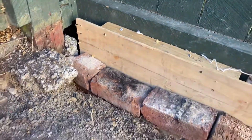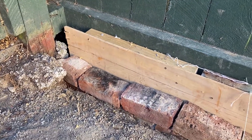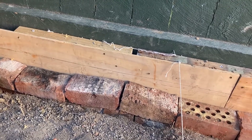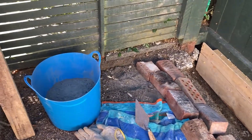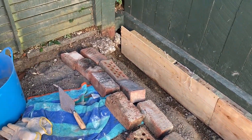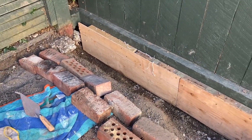What I'm going to do now is start to pull out these bricks, mix some cement - quick mix cement, just add water - and start filling this area in, layering it up: firstly cement and brick, then cement and so on, all the way along. We're just about ready to get started. I've got my dry cement mix there, I've pulled all the bricks out and placed them in the exact same order they need to go in. So basically at this point it's just add-water time and start layering the bricks up.